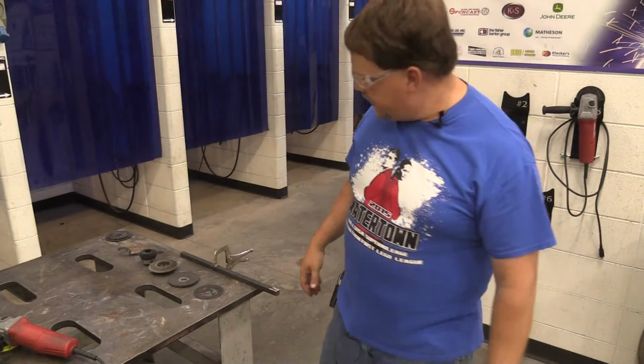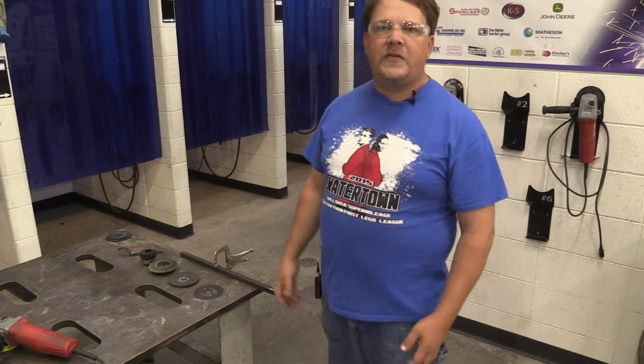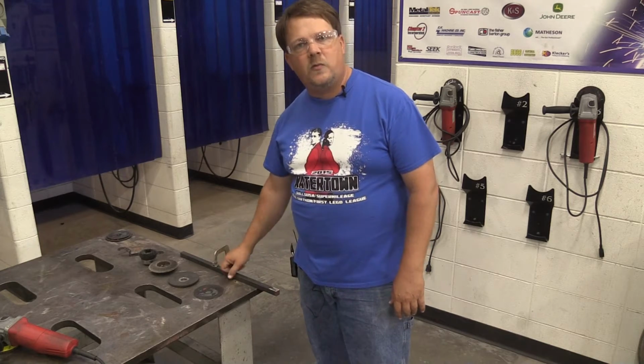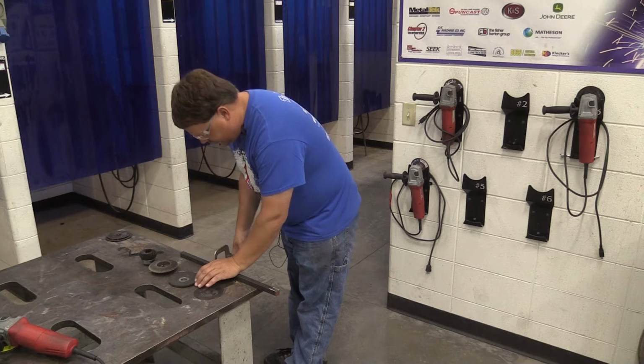We use those every day of our life for the rest of our life, and that's an area we don't want to hurt. So if we were to burn something, I'd rather it be the back of my fingers than my fingertips. Now, I hope that you never and I never burn myself, and by doing things like that to make sure we're coming up to stuff that's not hot before we grab it is going to prevent that from happening. Ultimately, by grabbing over here, you should be safe because the grinding was done over here as well. So if you're taking it out of the clamp and you're grabbing on this side of the material, it should be fine.